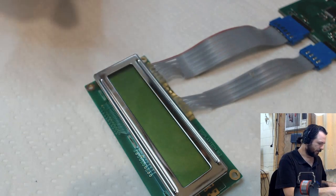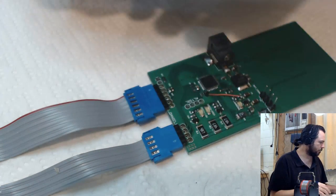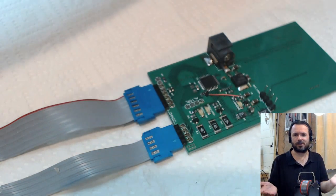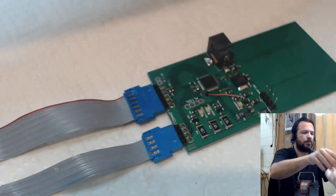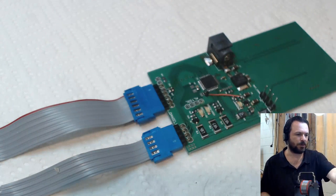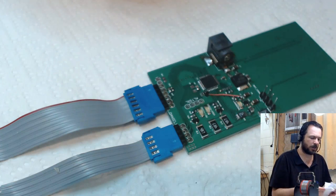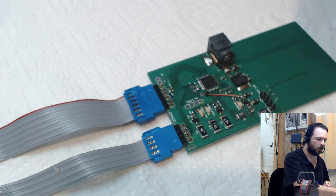Yeah, ZX, it's definitely a long, slow, painful process with a lot of these boards. I mean, even the simplest of things I've shown before, like the 5-volt regulator with the alarm built in. There's about 20-odd versions of that, and all it was was a simple linear 5-volt regulator. Yet somehow I ended up with 20 different versions before I finally came down to one that lasted more than a year without being changed. Some of the changes were driven by better parts being available, particularly when I changed from the ATtiny13 to the ATtiny10, that resulted in a significant sort of rewiring.